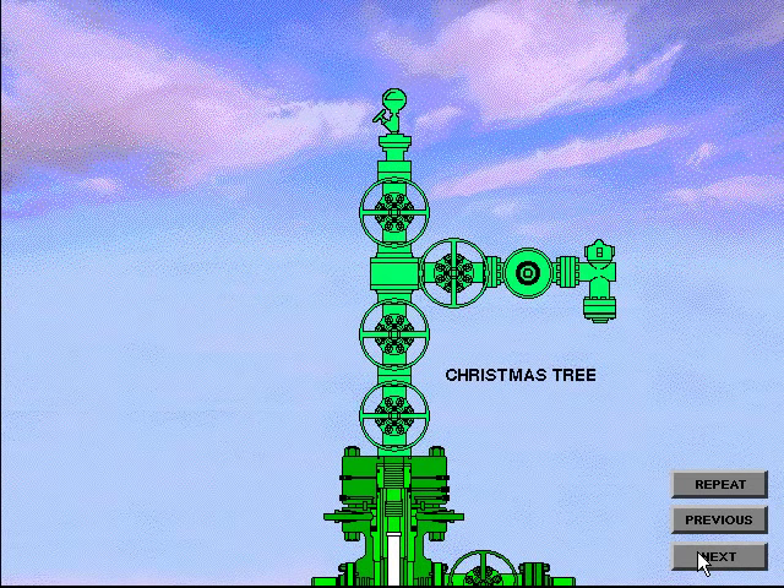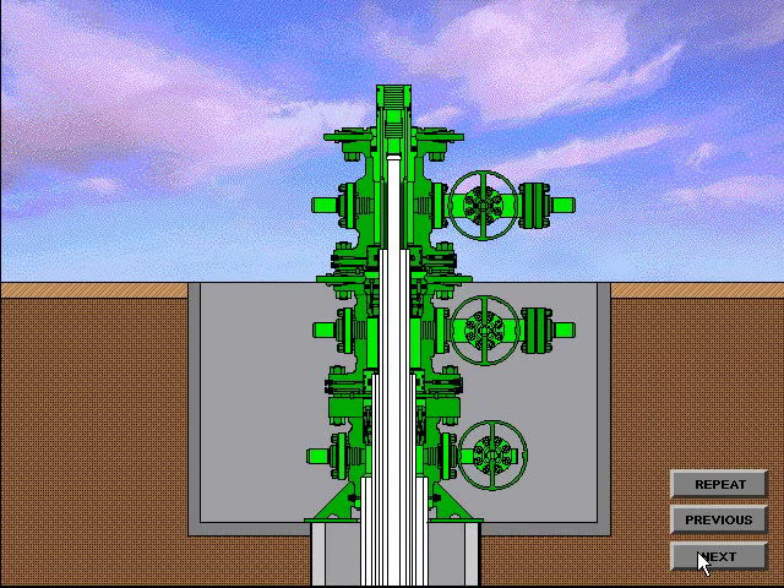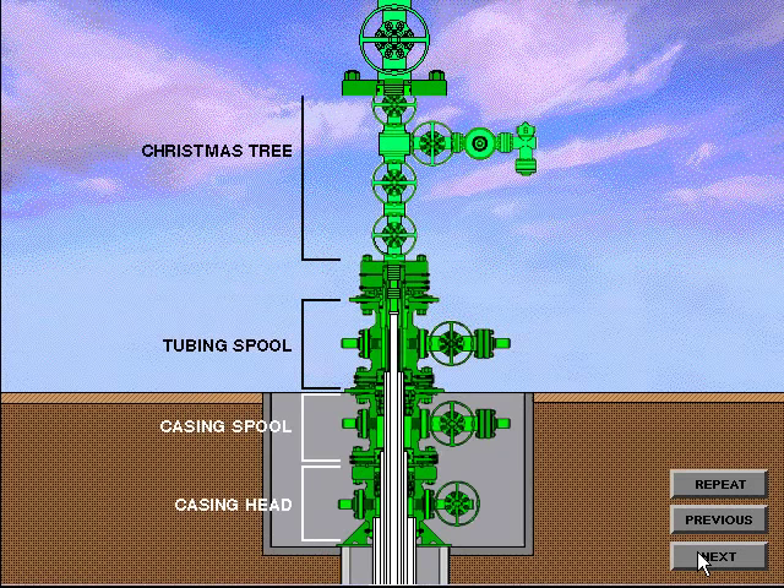The production Christmas tree is made up of a seal flange, which is often called a tubing head adapter, a series of gate valves, a T or cross, wing valves or side valves, and a choke. The Christmas tree is the group of equipment that controls the flow of the well. Each Christmas tree has one or more surface safety valves that will shut down the well in an emergency and prevent damage to equipment downstream. To install the Christmas tree, determine the direction it should be installed, pick it up, level it, and lower it over the extended neck of the mandrel tubing hanger. The Christmas tree is nippled up to the tubing spool and the connections and seals are tested. The well is now ready for production testing.